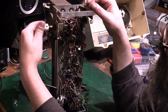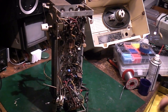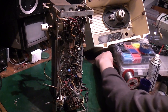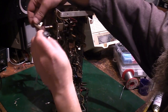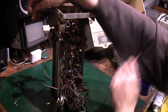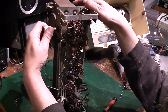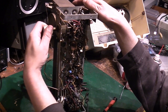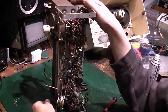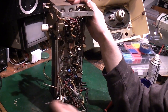I'll put the knob on. So just tighten the set screw. Once I find the right screwdriver, there we go. Just put it on mildly, basically, because all we want to do is just give that a work backwards and forwards while that switch cleaner is still fresh, like that. Make sure that them contacts are okay. There wasn't actually too much scratchiness on the volume and the tone controls down there. The biggest concern is that switch.